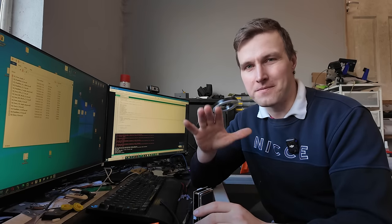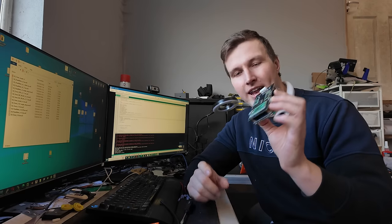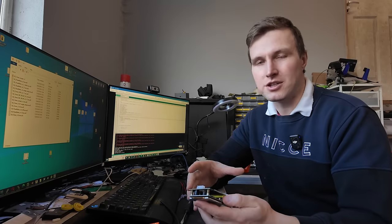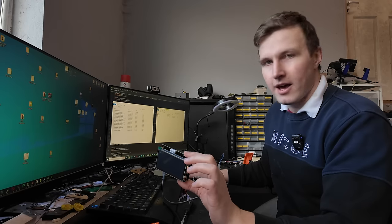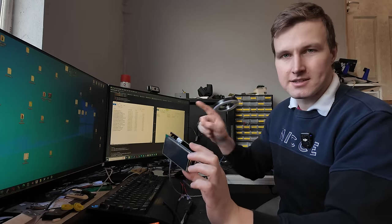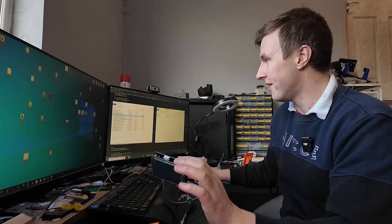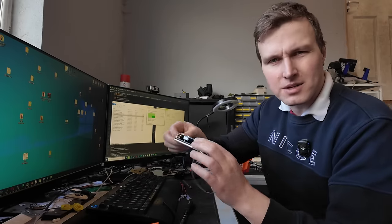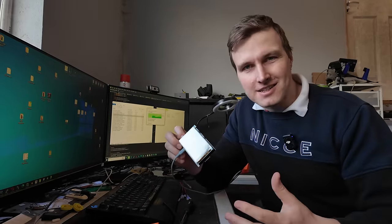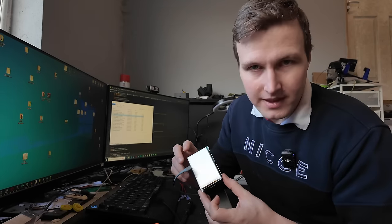This is kind of new, untested code — well, I have tested it, but I'm going to have to be careful. We're going to upload the code to these. I've already programmed the Bluetooth chip so that it can connect to an app on my phone. We have a window on this side — this is our controller — and we just drag the file from the left window to the right window and that will upload the code. As that's uploading, we need to hold this little button here which is like a program button, and that initializes our memory so that we have something in memory to read from.